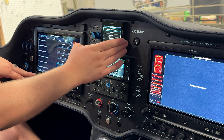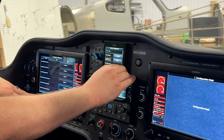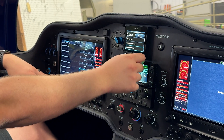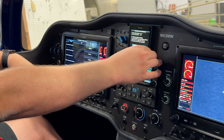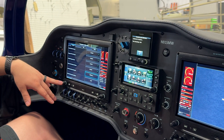Finally we move over to the G5. The G5 is very simple — we go to attitude, then down to calibrate pitch/roll. The G5 also has a yaw offset and a vibration test, but we don't need to do those in this case. We hit calibrate and again it's 30 seconds of being perfectly still, so we start that and wait until it's complete.